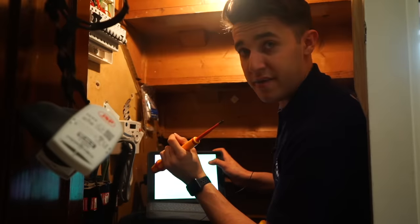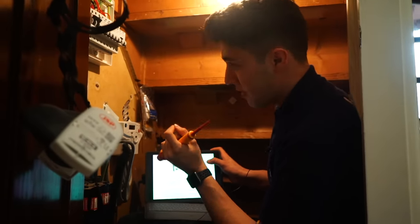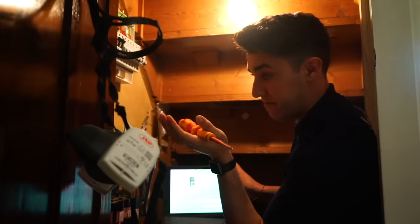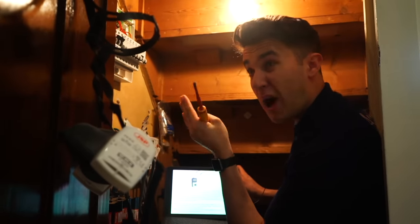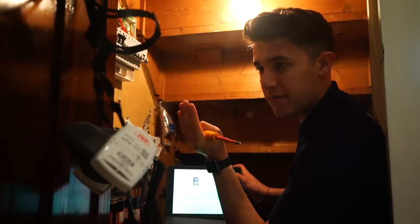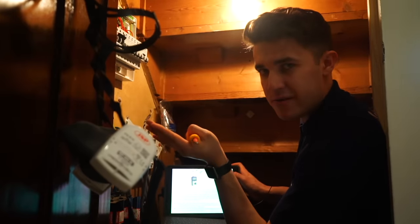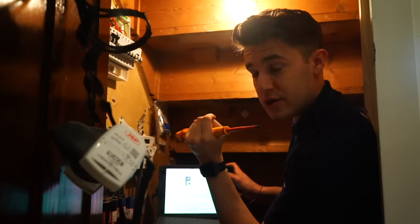Basically, as they'd say if you were from Wigan, what I'd do is I'd take my R1, so let's say it was 0.4. I would expect my RN to be about the same. I think it's like 0.05 of an ohm out before you'd really want to investigate. So say I had 0.43 or 0.39, I wouldn't be too concerned, but I'd expect it to be about the same on a periodic inspection.